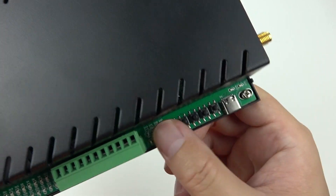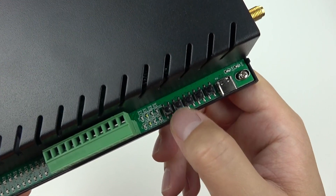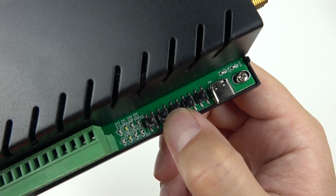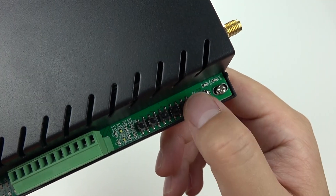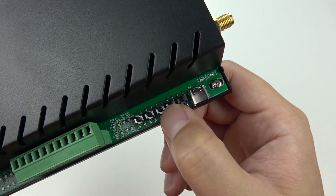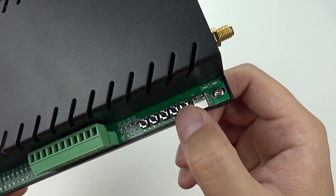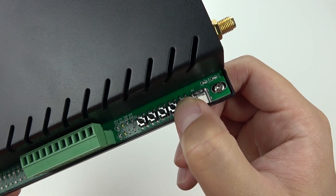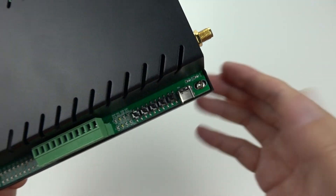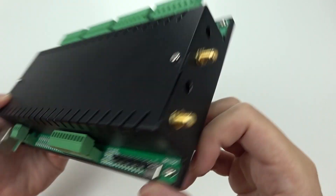Here are some buttons. The buttons allow you to change the Wi-Fi work mode and change the Ethernet work mode. And here you can reset the Wi-Fi of the Tuya. There are also two buttons that are for the ESP32, and this USB port is also for the ESP32. One button is for resetting the ESP32 and another button is for programming — you can define by yourself what function to assign to that key. And here are two LED indicators also used by the ESP32, so you can use your program code to control these two LEDs and read the state of the switch.